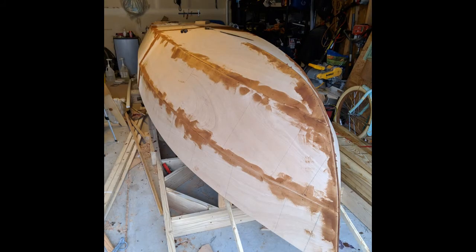So congratulations. We got this far. It's interesting to get to this point of the boat build and think that, yes, I've accomplished something, it looks like a boat. Now is the tedious task of filling every single hole, every single seam, and filling every little nook and cranny, including the underside of the boat. You have to go back and where all those stitches were, you gotta put filler putty in there. So this is gonna take a while.